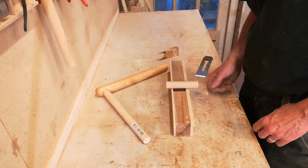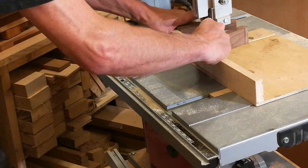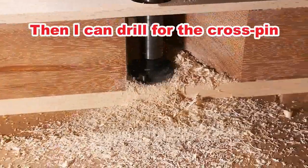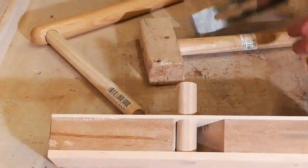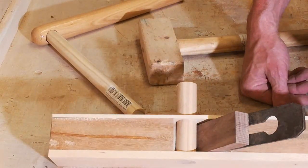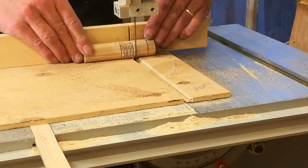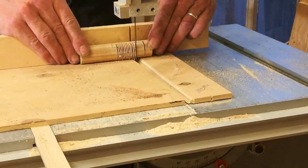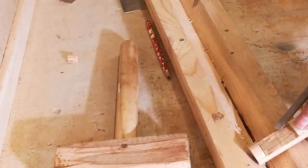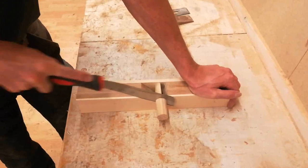Now I need to insert and position my cross pin. But before I can do that, I need to make the wedge, so I need to cut a new wedge. Can you see what a huge mistake I've made? When I insert the blade and the wedge, there's no room for the planer shavings. I should have made the angle of the front piece much shallower than I did. I'll try and save my project by cutting out a section of the dowel and then trimming it flush.